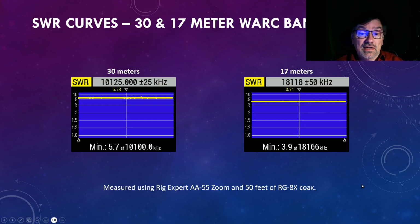The antenna is designed to handle 100 watts on sideband and 50 watts on CW and digital modes, so it will cover your standard activations with, say, an ICOM 7300 or an 891 from Yaesu, or any of the QRP rigs, and at just over 12 ounces for carry weight, the antenna is not that bad to use when you're backpacking in, say, with your QRP gear.